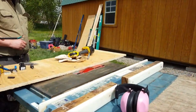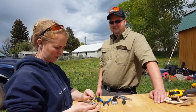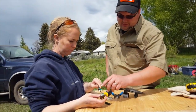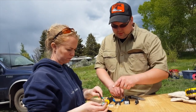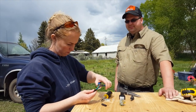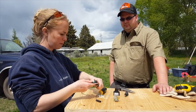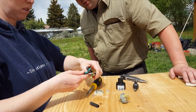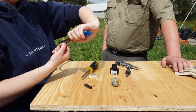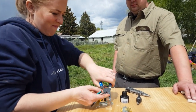So we'll just Google three-way plug wiring and pull the picture. You and your careful research. So are you just pinning them? This is a screw style, so what I would recommend is stripping off a little more and then we'll make a little J on the end of that. A little less — maybe like a quarter inch. Right there. Very good.